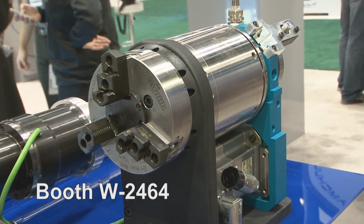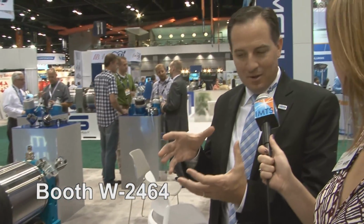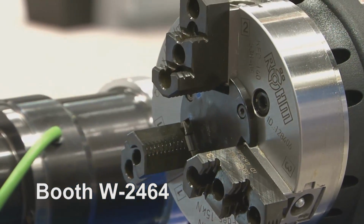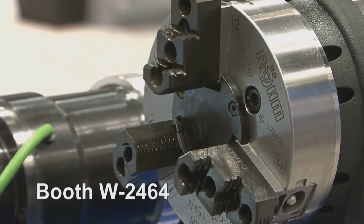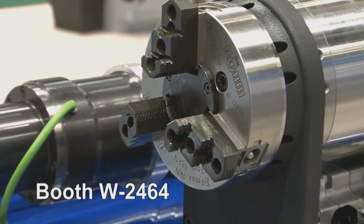So this is our latest product line, which is equipment, and it's basically servo-actuated cylinders to actuate the work holding for the workpiece. Most machines use a complete hydraulic system to actuate the workpiece. Those machine tools will consume about 14,500 kilowatt hours per year with the hydraulic system. Not to mention hydraulic systems also consume vast amounts of energy, but they also create noise, they generate heat, and they're one of the most prone failure systems on a machine tool.